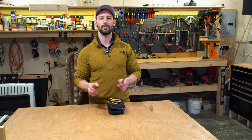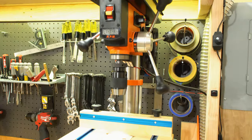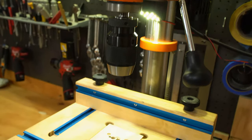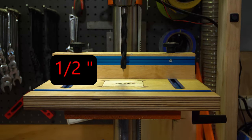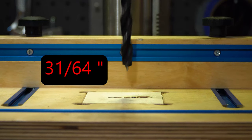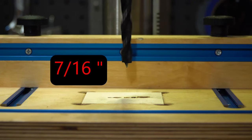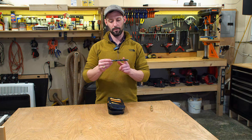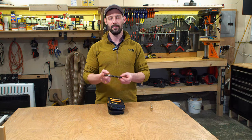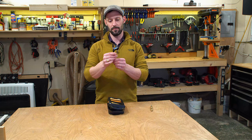So it would be very important to have this point go straight into the wood and not oscillate back and forth, especially if you were using a drill press. When I put the 1/2-inch bit into the drill press, I was convinced that my chuck was broken or the bit was in crooked. You have to see this — there is over one quarter inch of runout at the Brad tip of the bit. And it wasn't just the 1/2-inch; I tested a few more: the 31/64ths, the 15/32nd, the 7/16ths. After looking at them closely, I did determine that the actual spiral part of the drill bit itself is pretty straight, and the issue lies in the shank that goes into the chuck. It is so bad on this 1/2-inch drill bit that you can visibly see it is crooked.